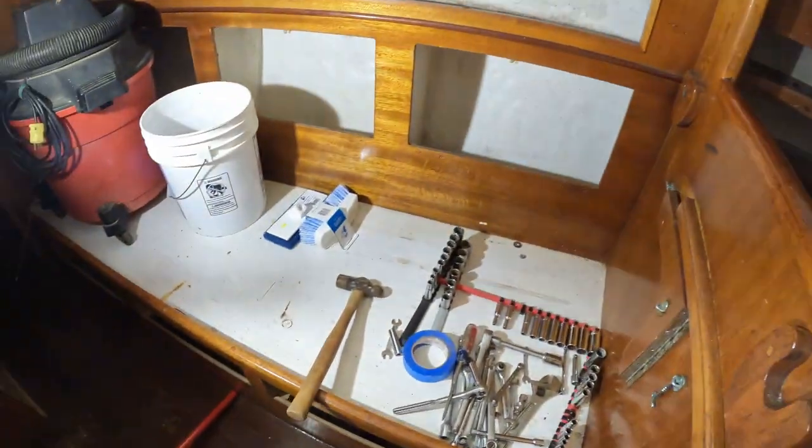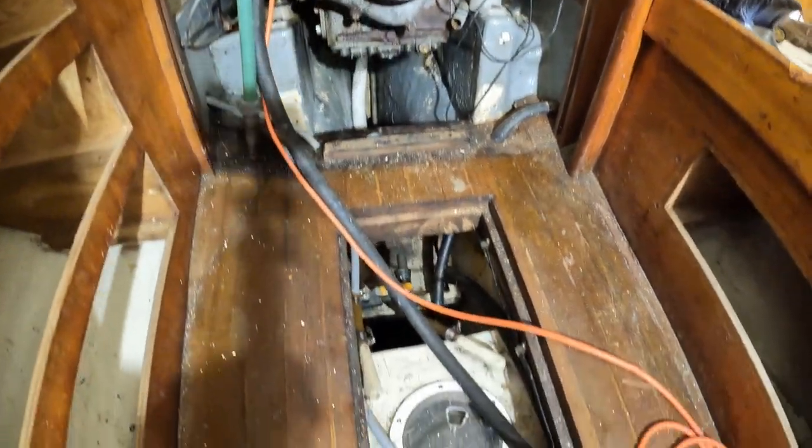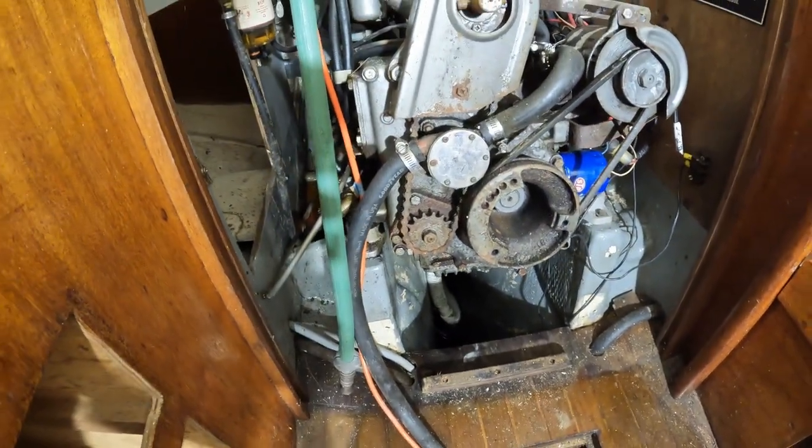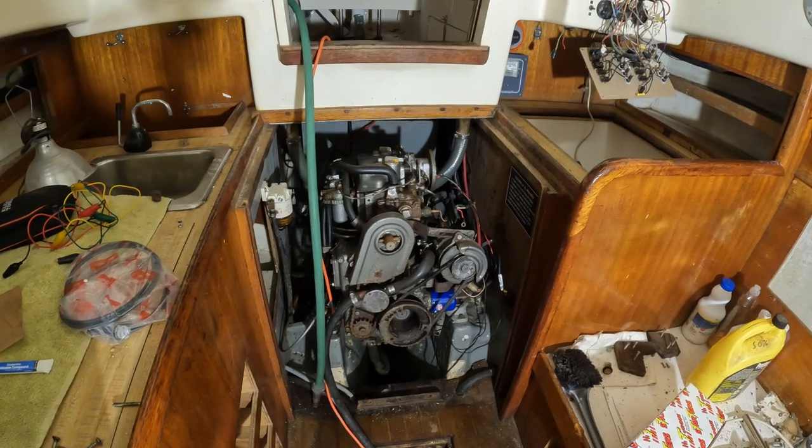I also bought a couple of scrub brushes I can put handles on. One of my goals is to really get down and completely scrub out the bilges all the way along, especially way down to the bottom of the keel, where in the last video I talked about the hole that's drilled into the keel. I'll put a silicone bronze plug into the bottom of the keel so that can be removed to drain all the water out of the bilges. Either I fiberglass the hole closed again, or we just put a drain plug in there so we can flush the bilges out and keep them nice and clean.